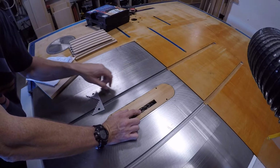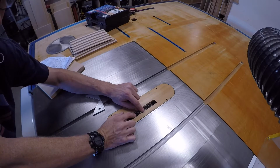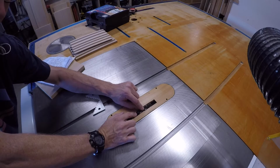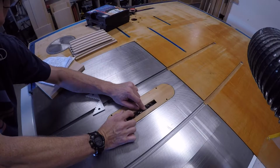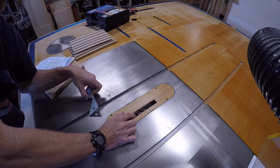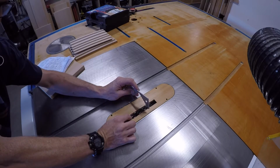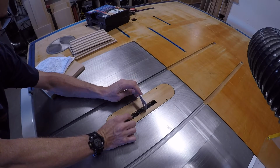And this guy, if you want to do the high alternate top bevel one and not the flat raker tooth, you can do that because that's going to give you your highest point, but the raker is going to give you the flat part. So if you have a set where the pointed part, the one that does the shearing, is a little bit deeper, I would suggest using the raker. This set is really flat, so there's not really a big difference.